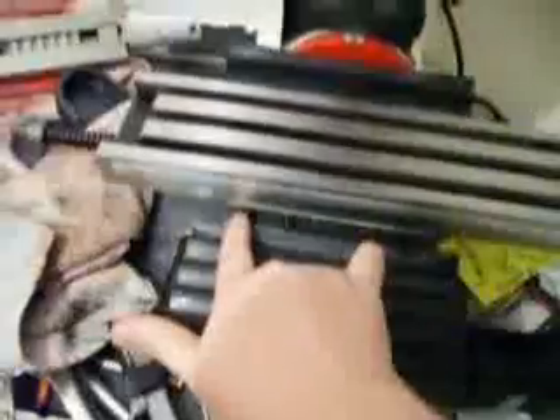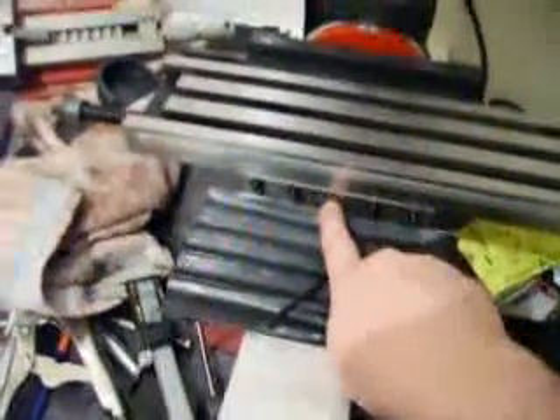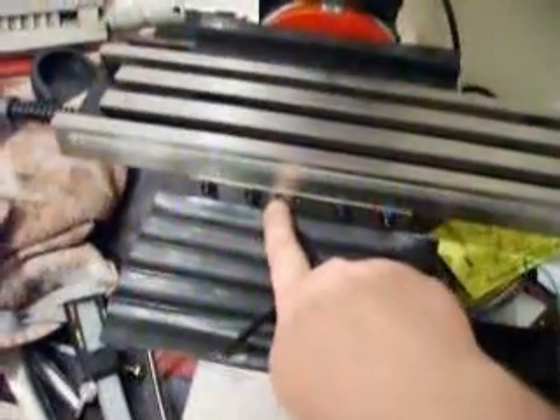I'm going to look at these mounting ends. Once you've got those just finger tight, I've used a 3mm Allen key — don't want them too tight, because you're going to lock off this bed. Just adjust them so there's no slop and it can slide back and forwards. I started with the two outer ones and then went for the inner ones. We can now refit the little scale, which was mounted in the left-hand one of those two centre holes.